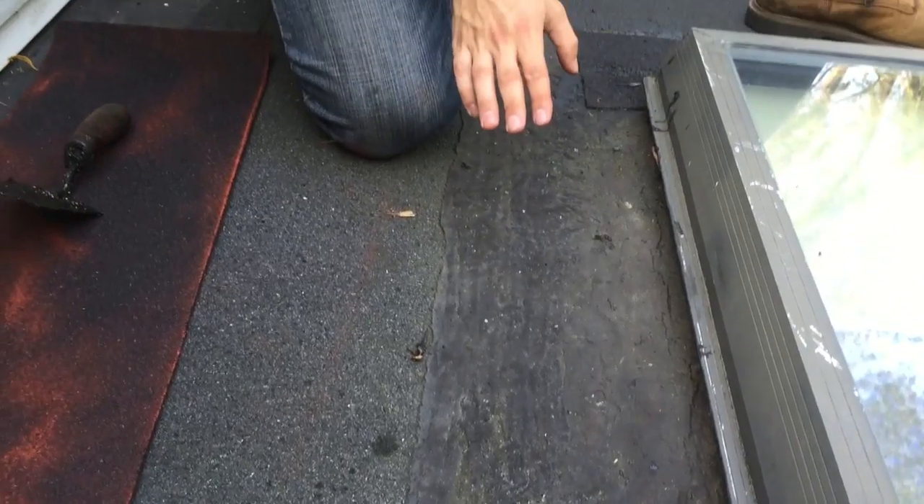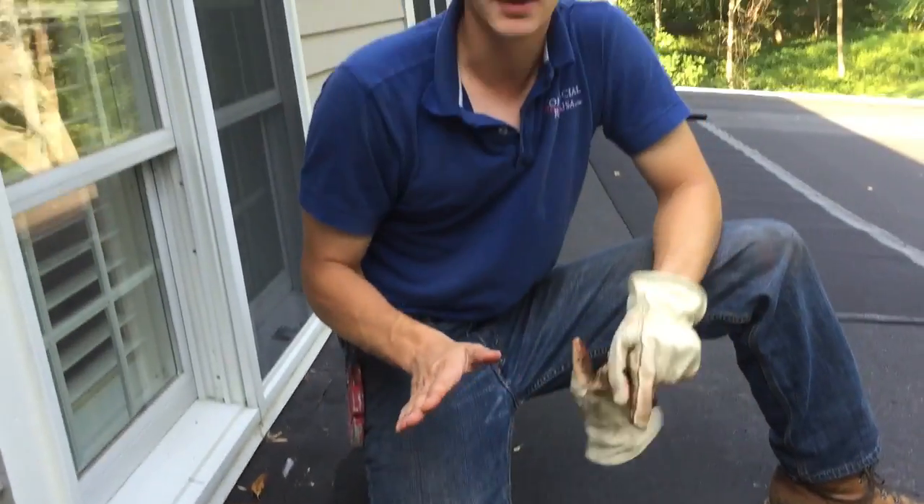You never tar to flashing — any flashing whatsoever. You need to either put tar and then put membrane over it, or put membrane directly to it, but you never put tar by itself.